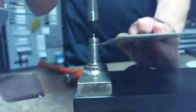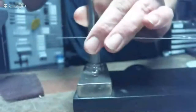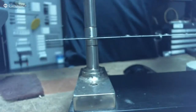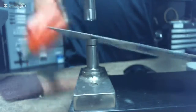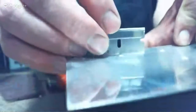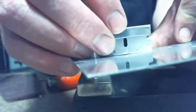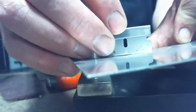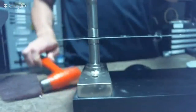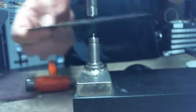I'm going to do one that's underdone — where I'm just not putting enough pressure on it. Usually people don't have this trouble, but once in a while in classes we found somebody that did. Now when I put a straight edge across that one, you can definitely see that it's leaving the straight edge of the razor blade. Obviously, that's not what you want because you're putting a dent in each place that should have a dimple.